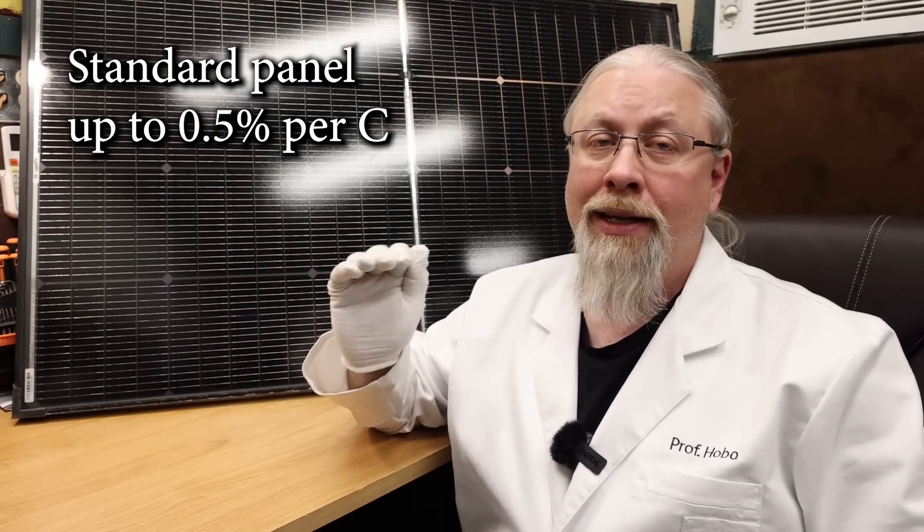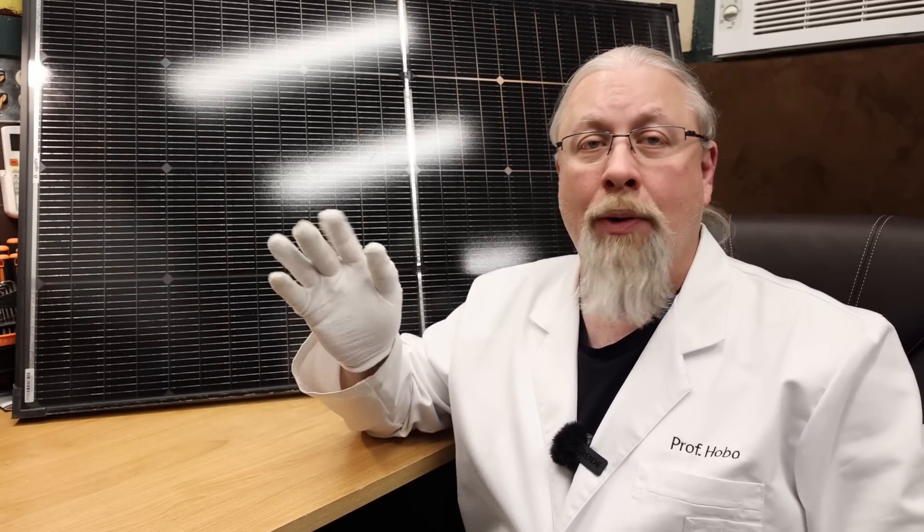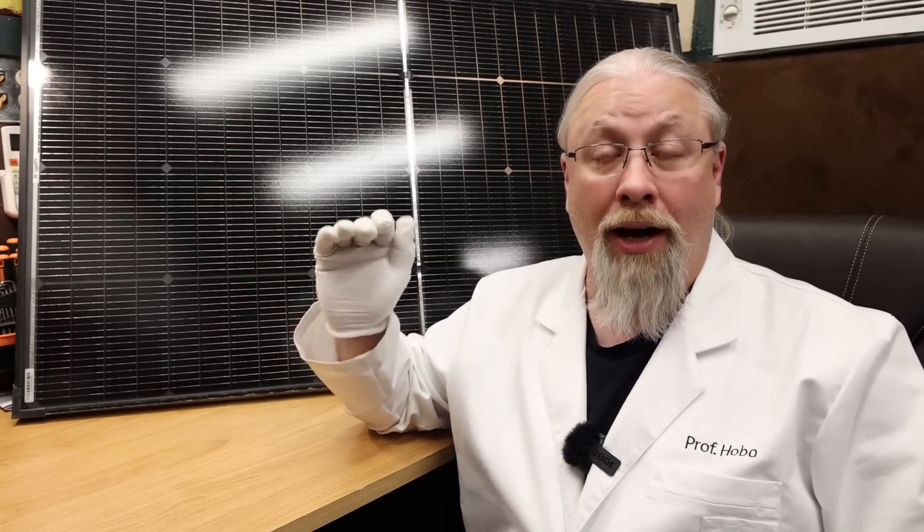You might wonder how they're squeezing 200 watts into such a small space. You can thank efficiency — these panels are rated up to 25% efficiency, a full two points higher than anything else on the market today, meaning more power per square inch. These panels are also highly efficient when it comes to temperature. Standard solar panels can have temperature coefficients of up to 0.5% per degree Celsius, whereas these have a low 0.32% coefficient. What all this means is that the hotter the solar panels get in the sun, the less power they lose compared to other panels. Bifacials naturally have a low coefficient due to their translucent nature.